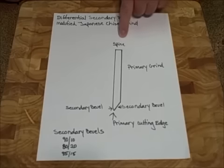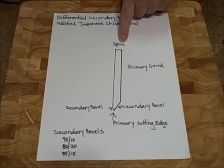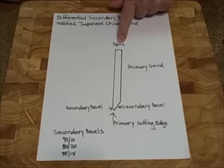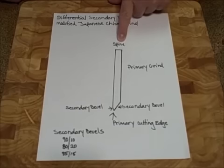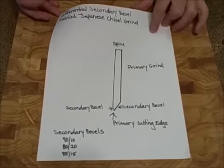When it comes to sharpening this kind of knife, you have to know how to set the angles to the stone, or at least how to touch the angles to your honing steel or ceramic rod. I wouldn't take a differentially ground knife or even a full-ground Japanese knife to a rod, but I would take it to a ceramic for a light touch-up. That's a basic covering of your kitchen knife grind types — let's continue on with sharpening on a rod.